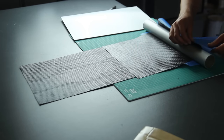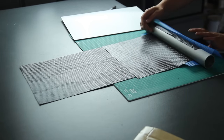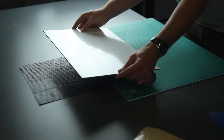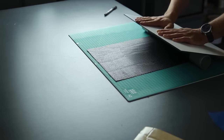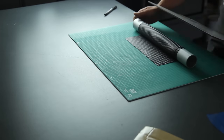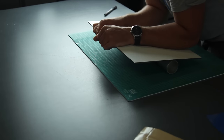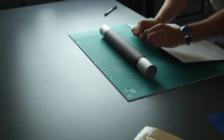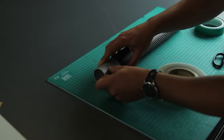The start is the most difficult part. I'm using the backing layer to avoid it sticking to the table, and then using a plate to evenly add pressure to the entire tube. I'm rolling the carbon fiber — this is a 0/90 degree weave, a twill weave. It's also possible to add biaxial or zero degree fibers.